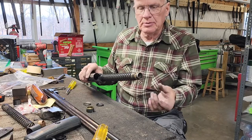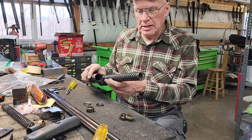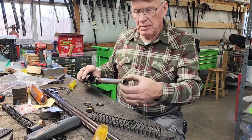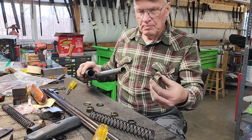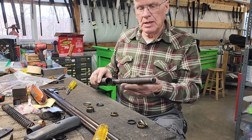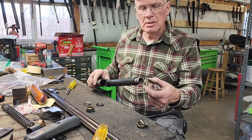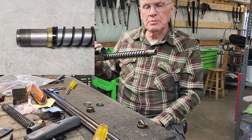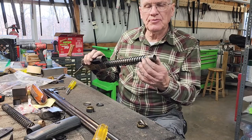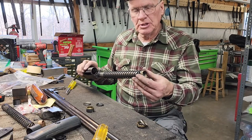There's a bevel on your barrel ring that's going to work on this top bronze piece, and all that together squeezes down tighter on the tube to slow it down. Now to shoot 2¾", remove everything. You won't be able to store anything underneath here because you can't put on that many rings — you're going to have to put these in your pocket, which is probably where you'll lose them. Just set it up for 2¾": spring goes on, one steel friction ring bevel up, and one bronze piece. It's now set up to shoot 2¾". They generally will, though sometimes you have to experiment — they won't necessarily shoot real light trap loads, but Browning doesn't guarantee them to shoot that way.